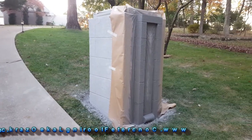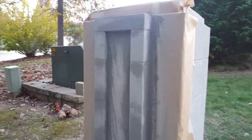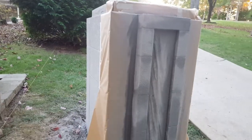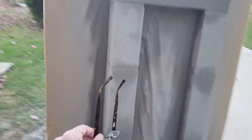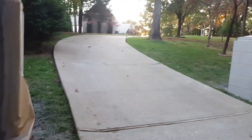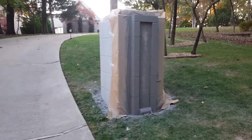It's still wet — it will lighten up some, not a whole lot, but it will lighten up some. Over here we sprayed this one first and you can see where it's lightening up already because it looks splotchy. You see the dark spots and the light spots — that light area is actually dry right now. But that will darken back down as we seal it tomorrow. Once it's sealed it will go back to the darker shade. It dries quite a bit lighter, so this one is considerably darker over here, but they turned out pretty nice — I'm happy with them.